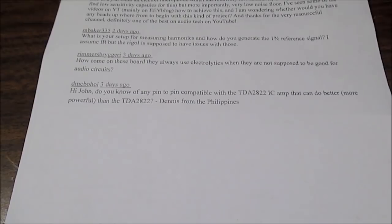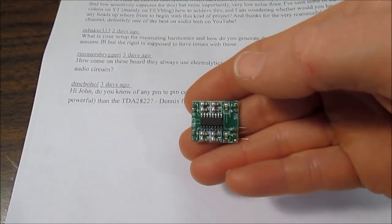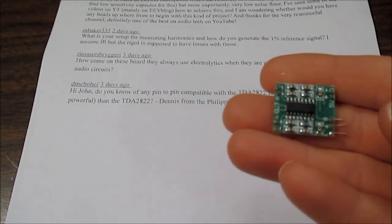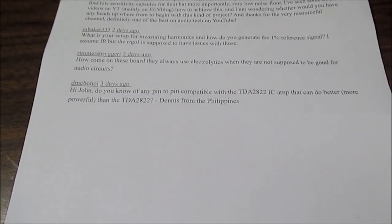And if you're not bound to using linear Class AB type amps, you can use these little boards here. This is a little stereo PAM8403 board. You are limited to up to 5 volts, but because the outputs are bridged, you get very good output power. You can use them with 4 ohm loads, so that might be worth considering.